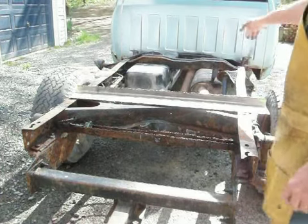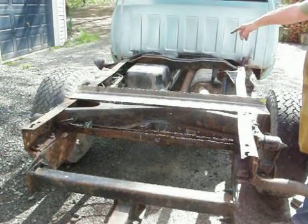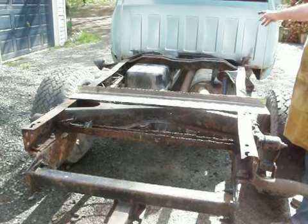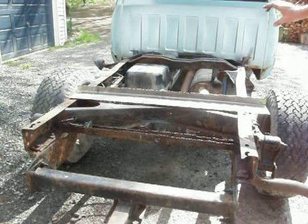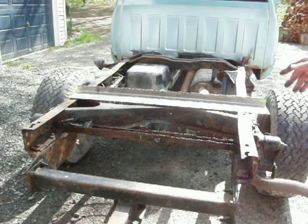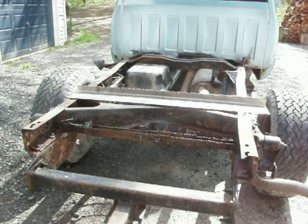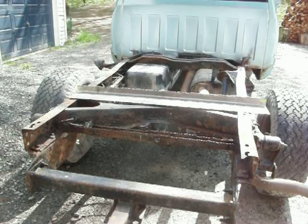When it comes to those other ones, these here, they obviously need a shape because of the gas tank and the muffler on both ends. So what I'll do is I'll cut those patterns out, just like you see them there, looking like a saddle or whatever. I'll cut those out in a flat piece, and then I'll go ahead and weld the bottom onto that, and then I'll weld the top one. I'll make like a box beam rather than that U-channel, because I can put bolts down through that U-channel ahead of time for the gas tank and all.